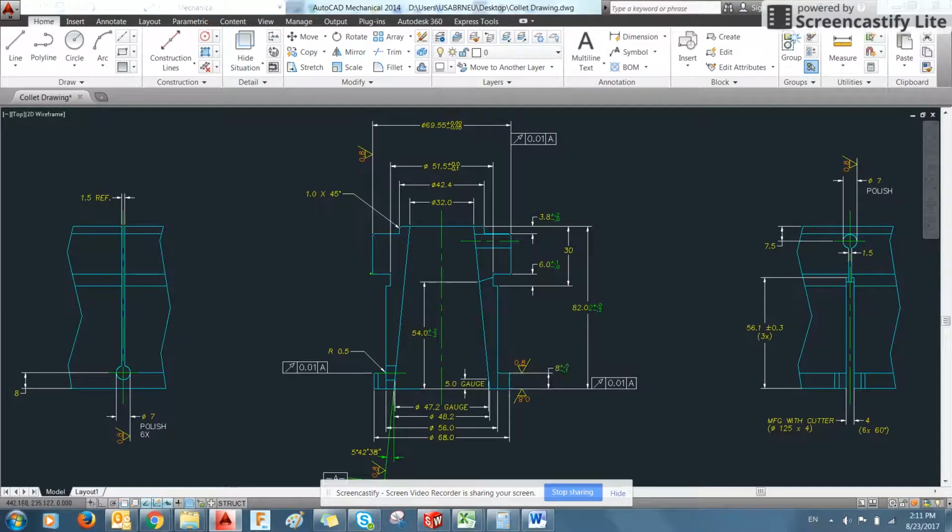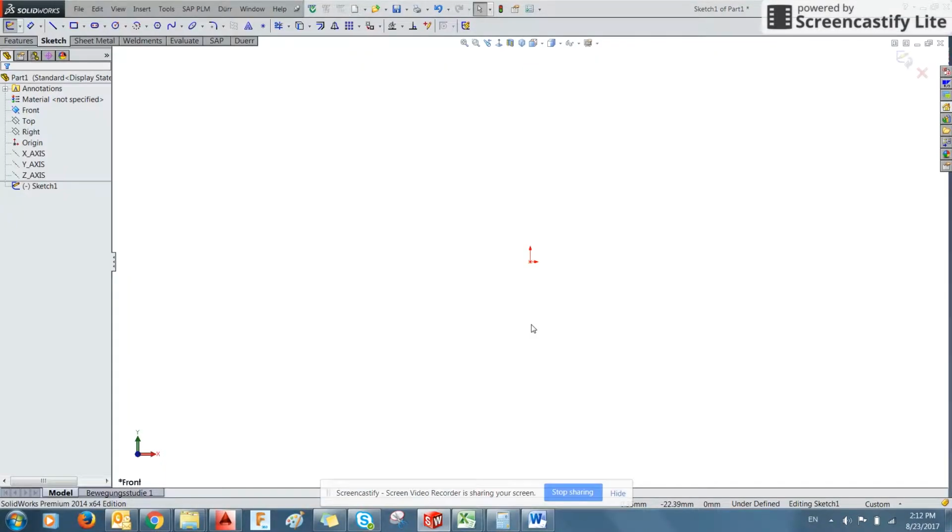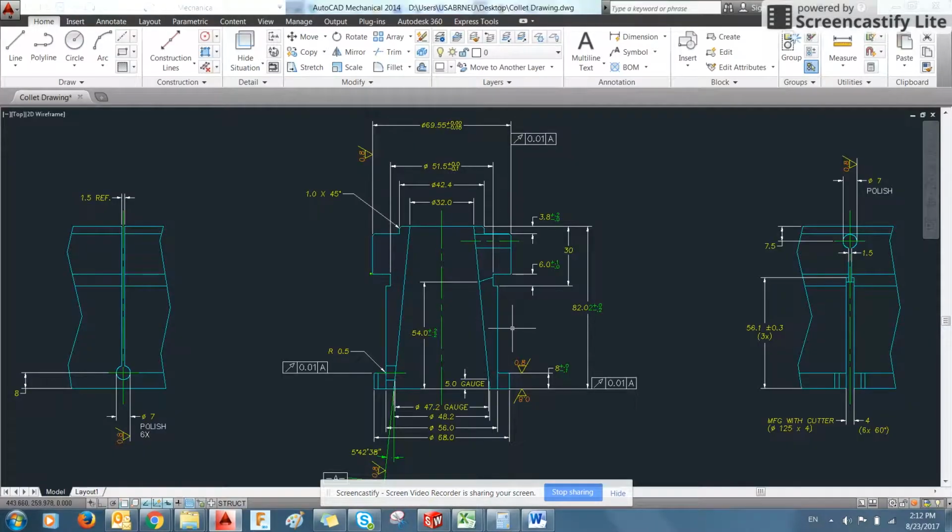Well, since we're going to be creating those feet, actually let's do that as an additive feature, not a subtractive, which gives me something good to talk about. There's 2 schools of thought here. You can either make a cylinder and you could subtract all of the geometry to create the shape, or you could create it and add onto it.